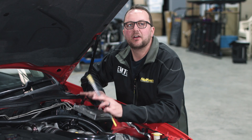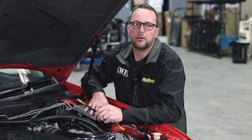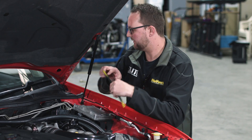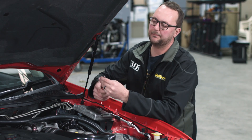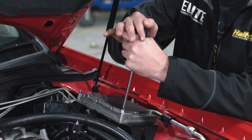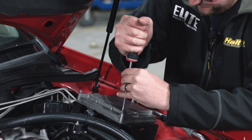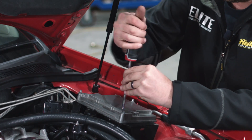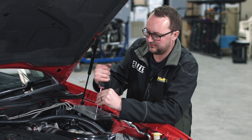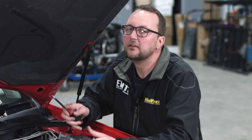We're finished cutting. It is surprisingly hard work, but they are tamper-proof bolts — if it wasn't hard, they wouldn't be tamper-proof. Now I've cut a nice slot in here, I'm going to put my hacksaw blade down, pick up my giant screwdriver, sit it in the slot I've cut, a few good bangs down, all your weight on it and a good twist — and she's out. Once we unscrew that all the way out, one down, two to go.